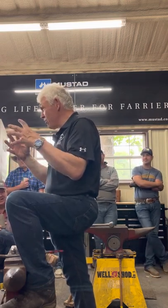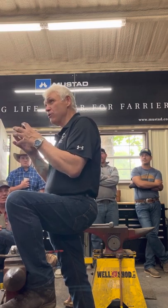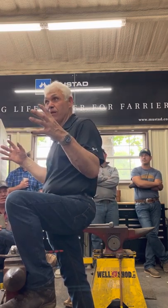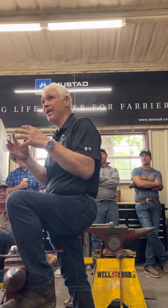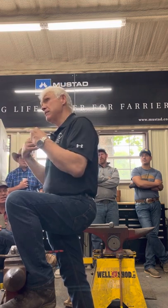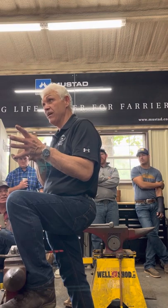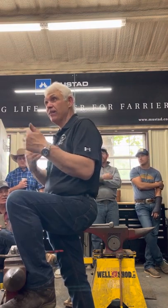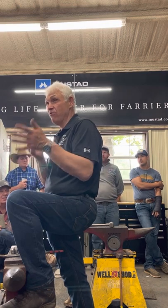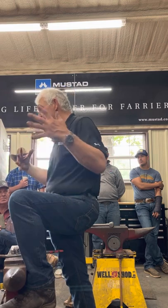So that's why I could hit my punches harder, but all they're going to do is distort the material more. So sometimes I've got to go around three times because my steel is too hot at that point, so I've got to go into it lighter. Sometimes I'll go in a bit heavier because my steel has lost some temperature, and now I've got to hit it harder. But it's knowing what the effect's going to be. If you do something to really hot steel hard, you're going to get a lot of displacement.